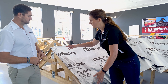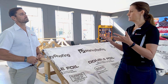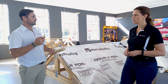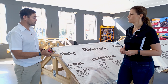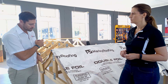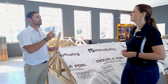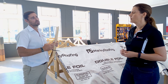But now, let's say your measurement that you've worked out using the 320 measurement and you've divided it, but it doesn't work — it doesn't round off 100%. What you're going to do is, let's say it gives you 318.1 or 318.2 — you can work on 318, especially if it's on a smaller truss. It's going to give you the exact spacing you actually need. So it's okay to basically increase your headlap, but just never decrease it. It's better to increase, but let's try to stay closer to the norm, which is 320 millimeters.